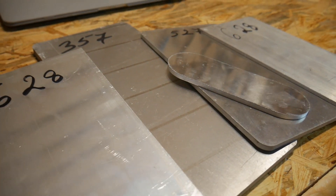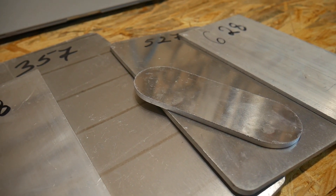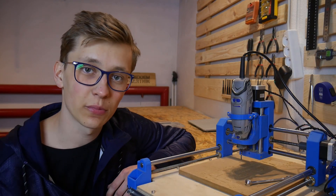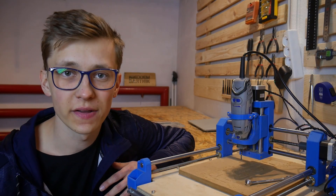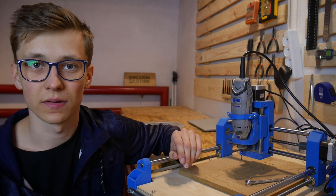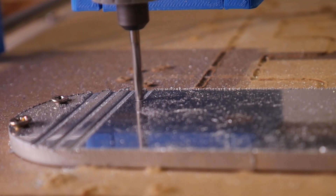I have different sizes of aluminum sheets — these are scrap pieces that someone sells online really cheap. That's a great way to buy inexpensive material so that you can learn how to mill aluminum on a budget. The first thing we have to do is find the depths and feed rates to use while milling. I already did that before, so let me just quickly explain how I did that. Keep in mind that depending on the spindle speed and material you are using, those values can vary a lot. All you have to do is try different values starting slow and shallow, and increase them as long as everything seems to be fine.